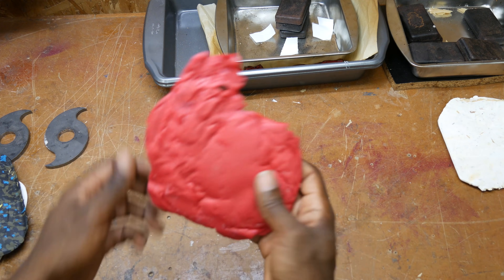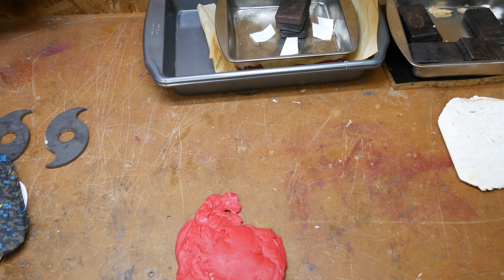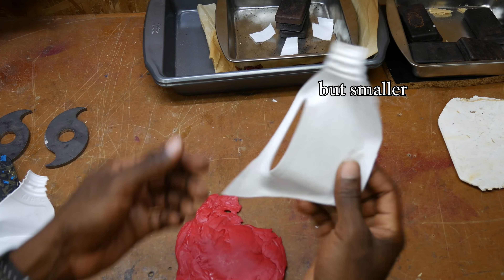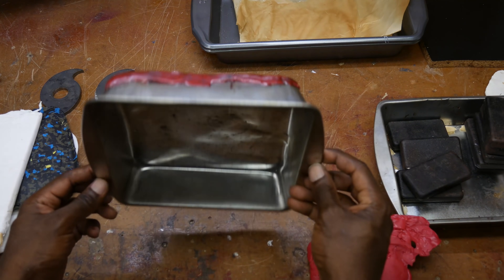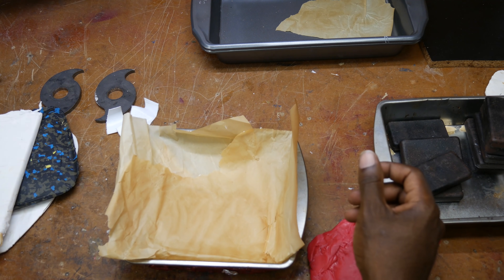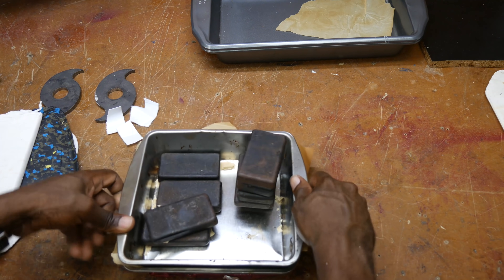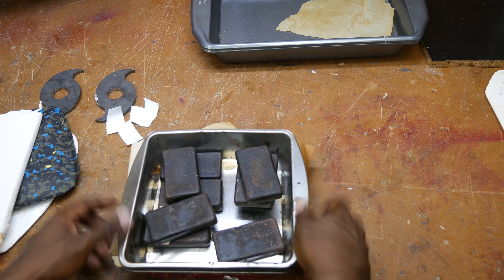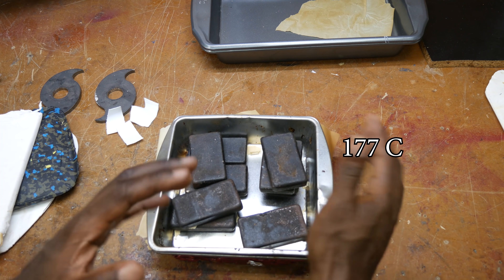This comes from a red watering can which was HDPE. You can tell by looking at it that I processed this very, very little — the pieces look something like this. I left the corners, didn't go through much effort to make it flat, and left some of the ridges. The process was: I took this pan, put parchment paper inside, put all the loose pieces inside of there, then put another tray on top the same size so they nest inside each other, and put weights inside. All of these samples were baked at 350 degrees except for the professionally shredded plastic.